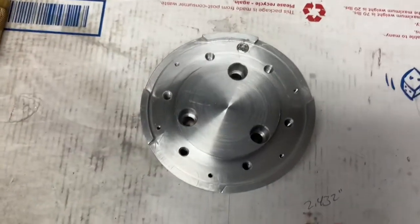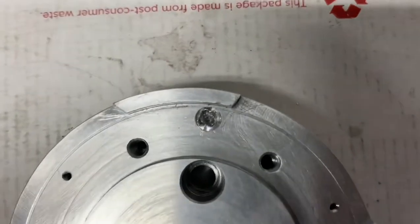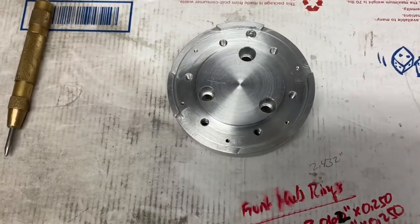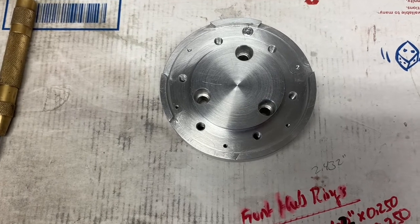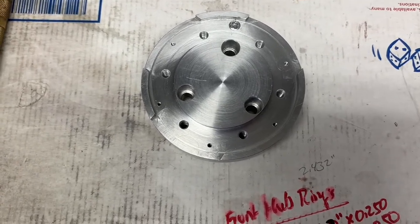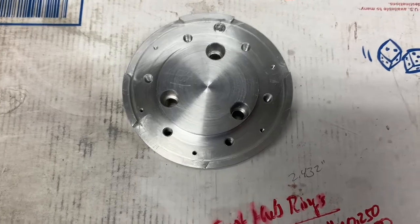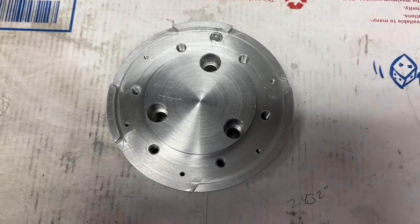So if you screw up an aluminum part beyond repair, that's too big even to get a helicoil in it, that crater, this is the only way. You could also just press in a smooth round slug of aluminum. But I figured since I'm going to be tapping it, I wanted to have some threads. Red Loctite, it'll never come out, it'll never work its way out. This is a completely non-critical part, but I feel like you could probably use it even in a critical application.